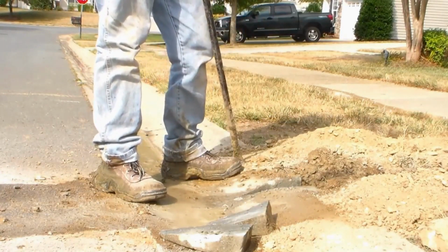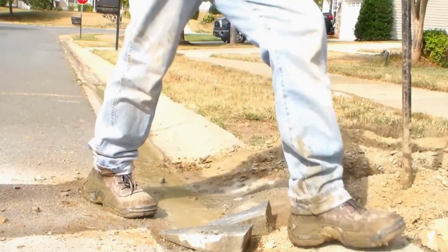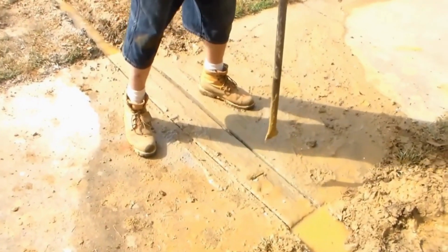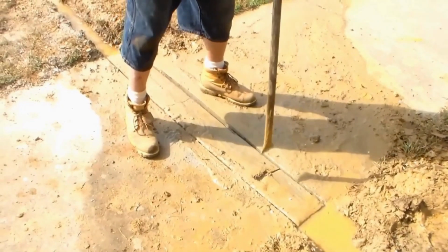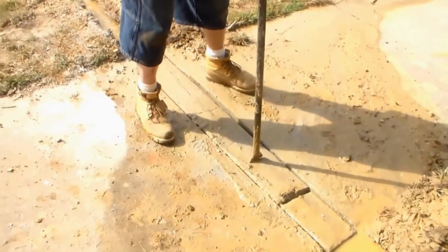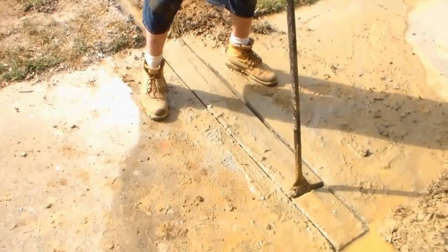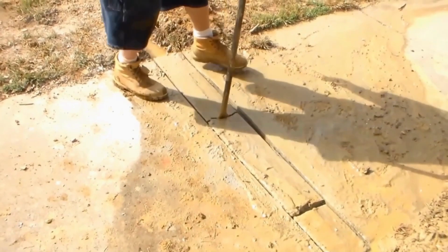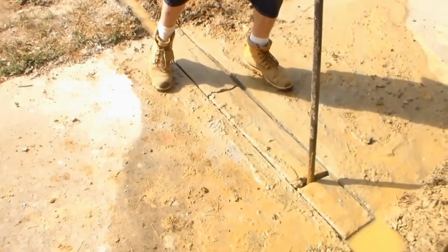Next we'll go ahead and break that section of sidewalk. We'll let Derek do that, he's good at that. Basically you just keep hitting that concrete till it cracks, and you break off little pieces. There goes the pieces, got already cracked behind him as well. That'll pop right out of there. Just pull, no, it's already cracked behind you. Oh, okay. Yep. Now you can just pry them up and lift them out. Then you trench through there, and you're done.